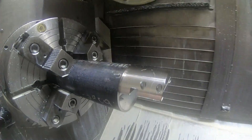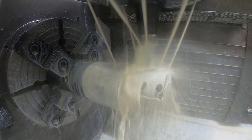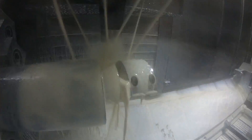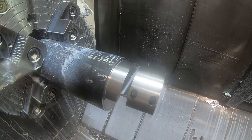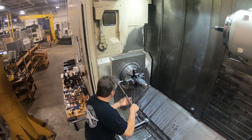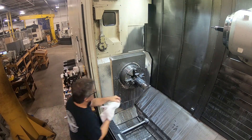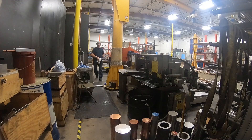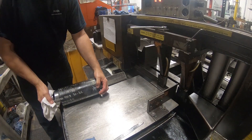After this I come in with a half-inch end mill to knock out some of that stock behind the part a bit more so I don't have to saw through as much. I probably could have just sawed it off or even snapped it off, but I didn't want it to drop off into the chip conveyor, so I left it hanging on the stock. I'm going to take it out of the chuck and go over to the bandsaw - which is right behind my machine - and cut it off.